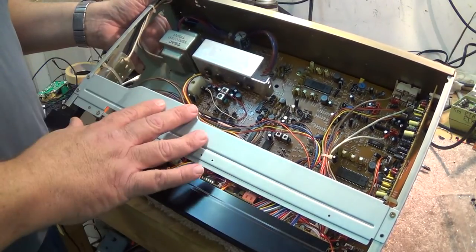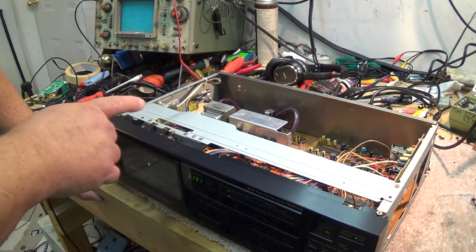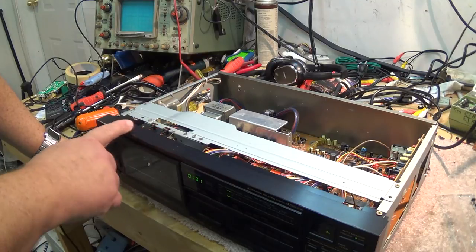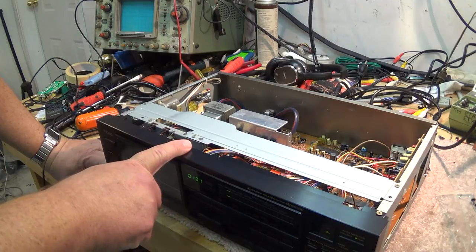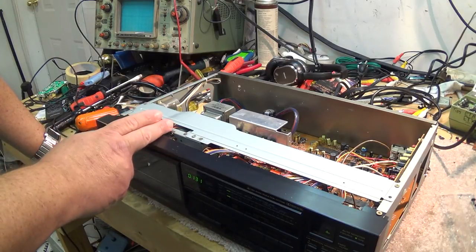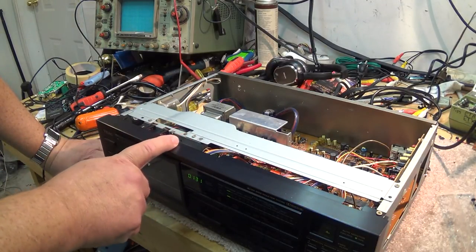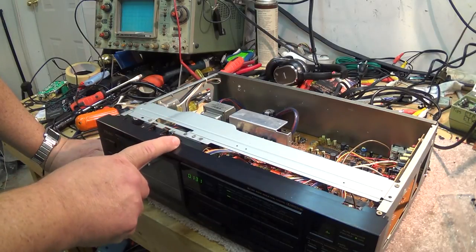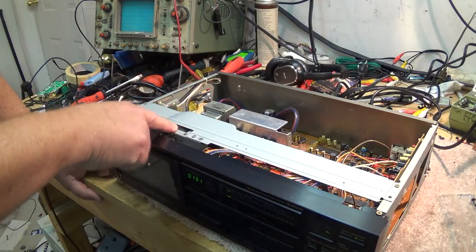Technics uses a direct drive capstan motor. This one's a belt drive capstan motor, and it used one motor that would control both the tape reels and load and unload the mechanism. And it used a third motor, which is a low power motor for the take up spool on play only. So it had a high torque direct drive for fast forward and rewind, which really ripped tape from one end to the other quickly. And a separate motor for playback and record, that was a very low torque motor. And it used the main fast forward rewind motor to load and unload the tape.